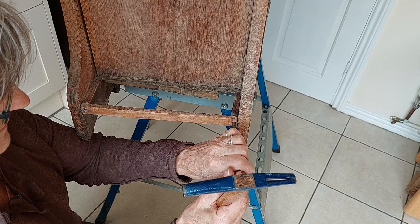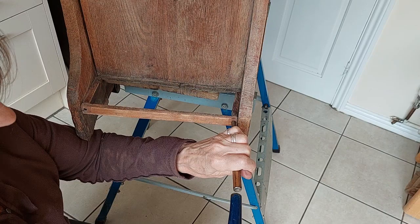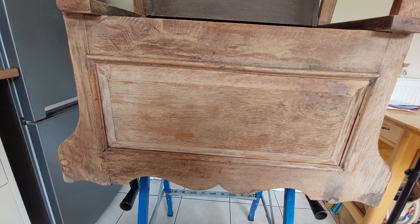I am going to replace it with nails this time so that it stays more firmly in place. The next thing is to replace the end — take out the old nails, give it a sand, and nail it back in place. Because the end is split where the old nail was I've just moved it along a bit, then I can fill that hole. I just nailed slightly through this bar so that I can get a grip when I put it on the ends, and then just tap it home. If you have a nail in an awkward place and you can't get in there with your hammer without damaging your wood, you can just put a bradawl on the head of the nail and tap that home.